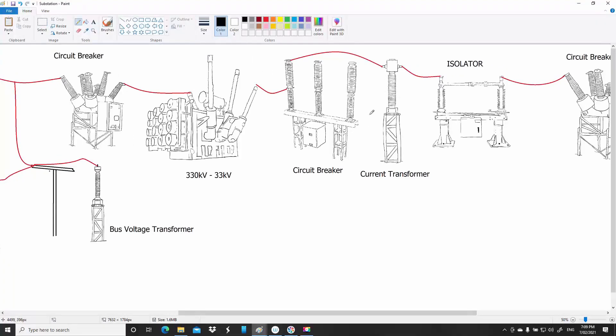On the other side we have a different type of circuit breaker. There are a few different kinds used for different purposes. The main difference between these two is that the one on the left has these little cans, and inside those cans are things called current transformers. The one on the right hasn't got them, so when you're using that type you usually have a post-type current transformer. A current transformer is used for measuring the current in the primary circuit — it'll take say a thousand amps and make it one amp, and then you multiply by the turns ratio to get the primary side.